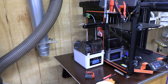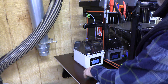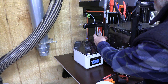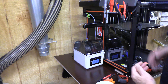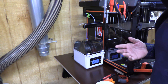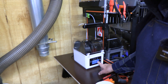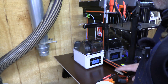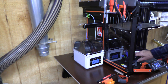I'll show you what I've used. I purchased these filament dryers on Amazon — they were $38 and go on sale. It heats and dries; you can have two spools, and it has Teflon tubing that allows you to feed the filament into the filament sensor all the way into the print head without it being exposed to the open environment so it stays dry. The screen says 45 degrees centigrade, zero percent relative humidity. It's warm in here while my workspace is cool, so keep in mind that's relative humidity, not absolute humidity.